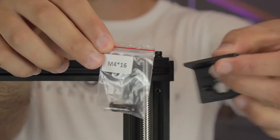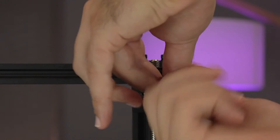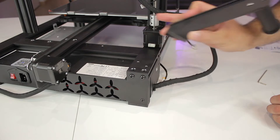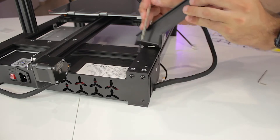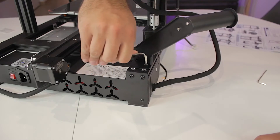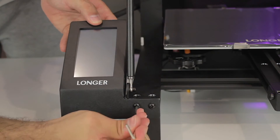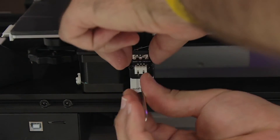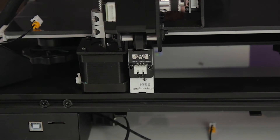Back to the build — we'll pick up M4 x 16 mm bolts and install the top part of the Z-axis lead screw so the threaded rod will be fixed in place and won't wobble. Next we mount the filament spool holder using M5 x 20 mm bolts at the bottom of the base. Then we install the touchscreen at the front of the printer. Finally, we install the Z-axis endstop above the white sticker on the side of the Z-axis and verify it clicks properly.